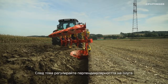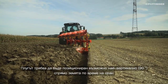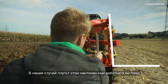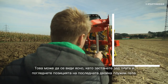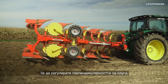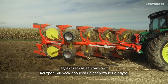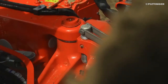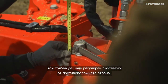Next, adjust the side-to-side leveling. This depends on the tire size, tire pressure, or working depth. The plow should sit as vertical as possible to the ground during plowing. In our case, the plow stands more on the coulter plate and must therefore be placed more on the coulter point towards the unplowed side — this can be clearly seen by looking from behind at the grind of the last coulter. To adjust the side-to-side leveling, lift the plow a few centimeters and operate the controller unit for the turning process briefly. Set the inclination with the spindle by turning it in or out. Once the correct spindle length has been found, it must be adjusted accordingly on the opposite side.